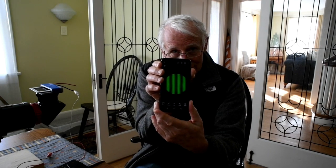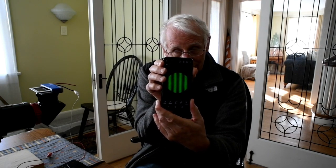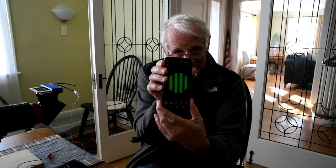And then to let it thermally stabilize, Tony, Larry, and I went out to have a really nice lunch for a couple of hours. Then we came back and I immediately took another inside of focus green light image with the scope in double pass. And as you can see, now the lines are straight up and down.